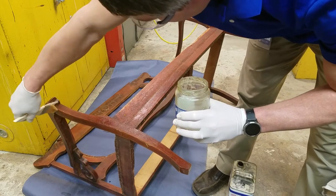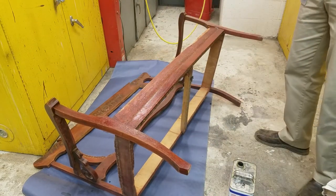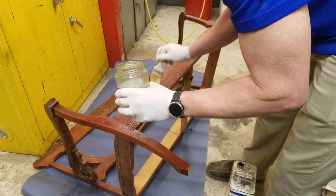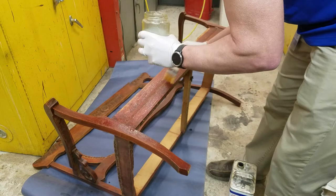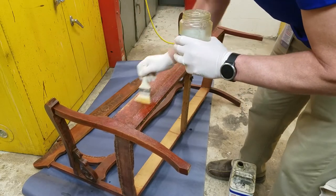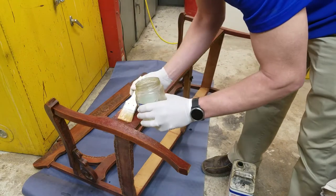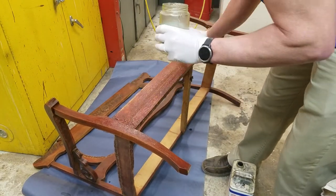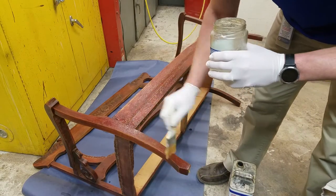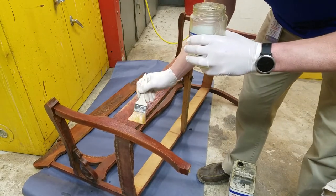In an afternoon you can take an old piece of furniture and almost make it new. My suggestion though: after you strip it, don't try to put a finish on that same day. You want to make sure the wood has a long chance to dry — over the weekend, or put it out in the sun. You want the stripper to completely evaporate out of the wood. If that stripper product is still saturated in the wood like a sponge, the new finish is not going to stick correctly. If you strip it on a Monday, wait till Tuesday or Wednesday.